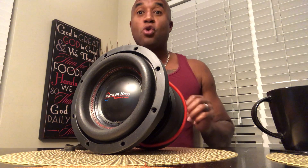The American-based HD-844 has a smaller moving mass. Motor force is sufficient to accelerate it quicker than the XAA V3, which has heavier soft parts. So the HD moves quicker — it accelerates quicker. It's still moving the necessary distance because its X-Max is 14 millimeters. It still reproduces the note, but it accelerates faster.